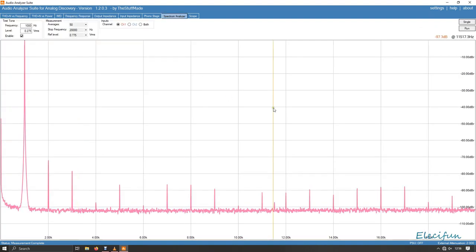I've put some averages on so you can see — there's the fundamental going in, the 2nd harmonic, 3rd, 4th, 5th, 6th, 7th. This is quite similar, apart from in ARTA we get to see a lot more because we're looking at a much lower noise floor, down around -120dB. Still, it's good — you've also got the spectrum analyzer in ARTA.